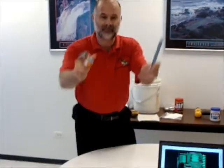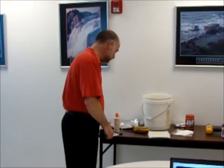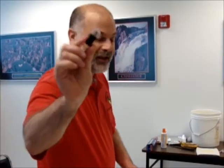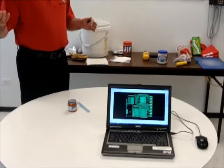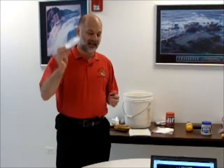The first thing you need is a Gerber file. A Gerber file has the data that comes from the customer that gives the information describing the printed circuit board. You can have data sent via CD or memory stick, and essentially you get what's seen here on the laptop — you have the circuit pattern, which is going to conduct electricity on the circuit board to give the function the customer wants. This is a viewer tool that allows you to see the data sent from the customer.